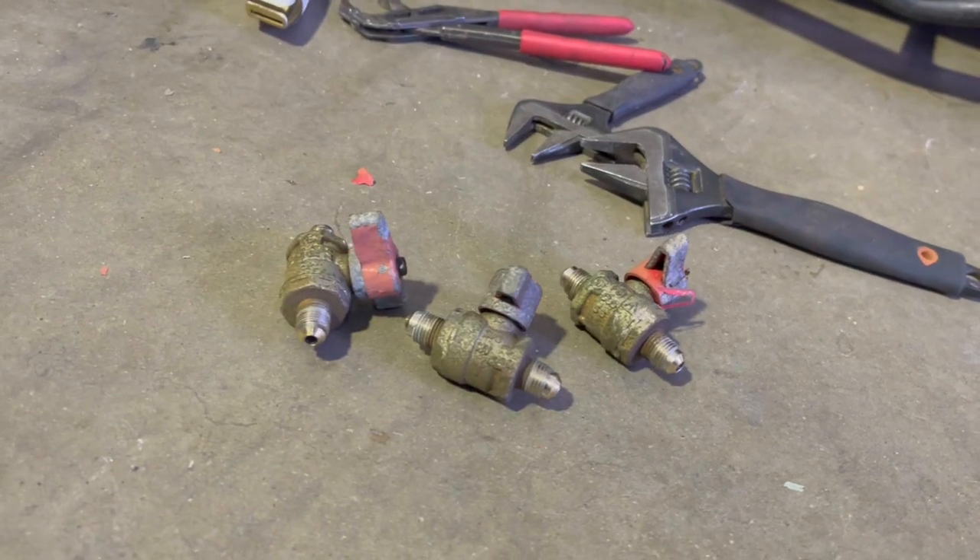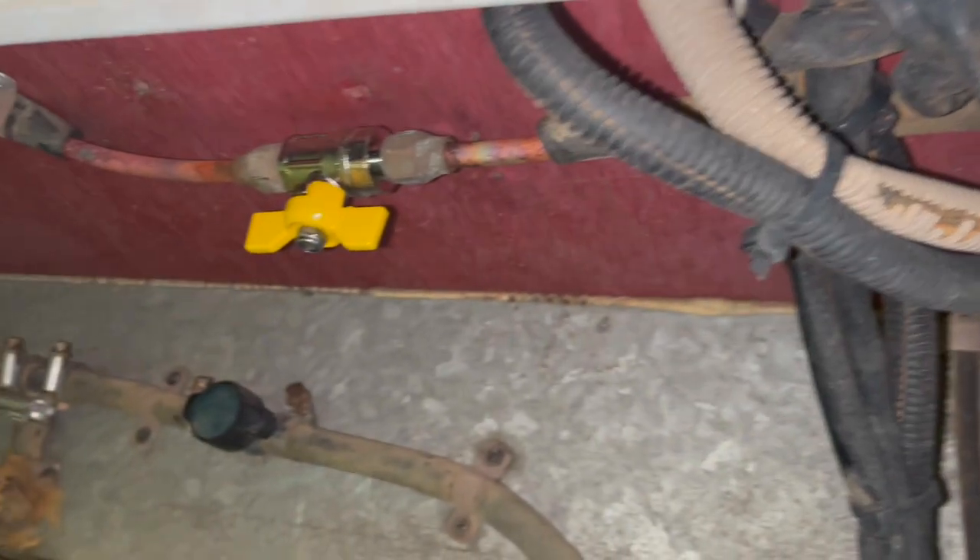There was a super slow leak somewhere - really annoying. So I took out all the gas valves, replaced all those, and then I could start isolating things. I isolated all the appliances: the fridge, the stove, and the hot water system. I tested it and it held. Then I put them all on again, tested it, and it started dropping. I started isolating each appliance and it came down to the fridge - somewhere in that fridge is leaking. Because as soon as I turned the fridge off, it would stabilize and stay there.